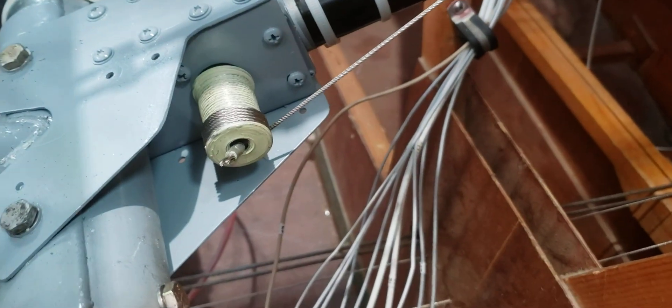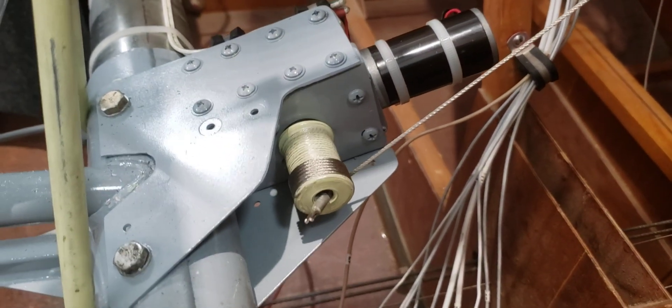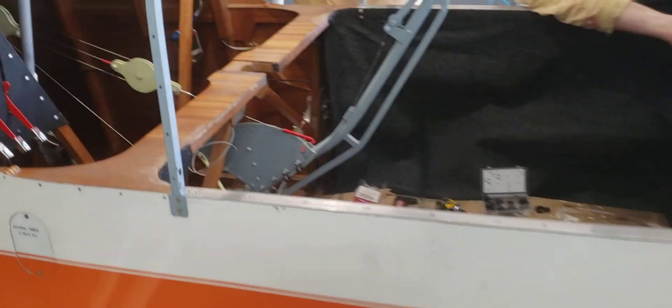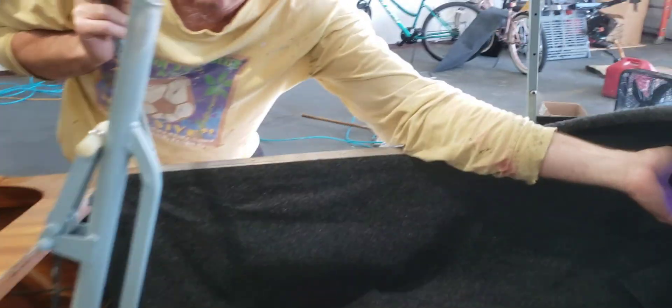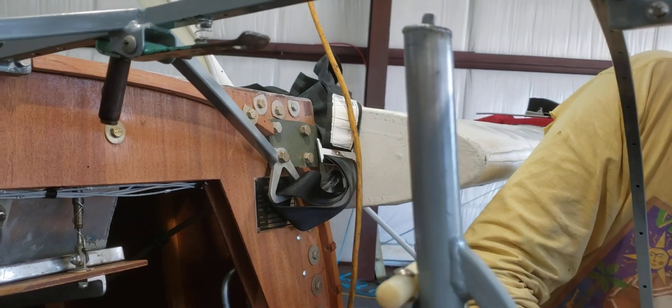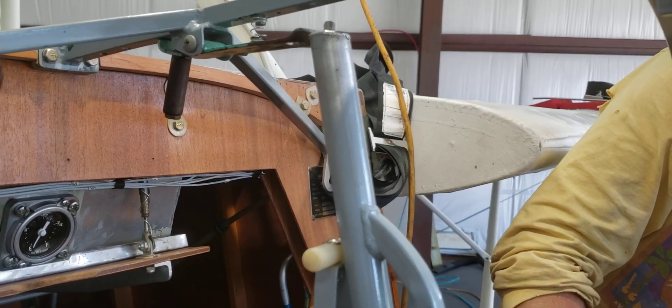You can come in here and watch the motor working. It's not even straining the motor. We did have a faster motor on there and it was straining it a little bit, so we backed off to a more powerful one, which reduces the RPMs — went from 40 RPM down to about 12 or 17 RPM, resulting in the slower operation. But I'm not having to lift it up, and I also cut six or seven pounds from the aircraft. We're going to have a micro switch shutting it off simultaneously when it clicks into the latch up here. She's just about ready to latch. Done.